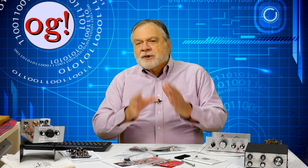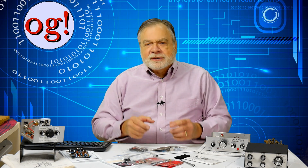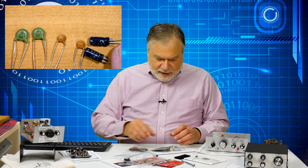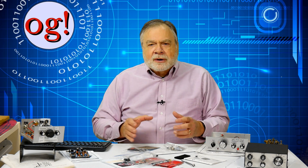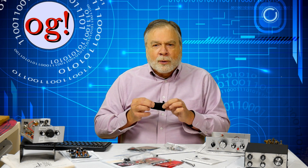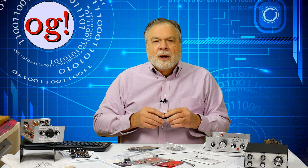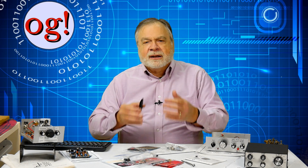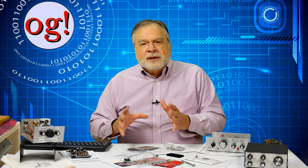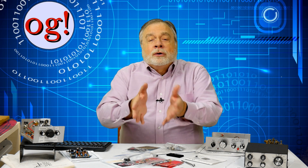Be careful of safety, such as problems that can be created by shorts or applying battery voltage incorrectly. Beware of the soldering iron itself, as it will burn your skin instantly. Wear eye protection so you don't splash solder in an eye. Some of the items you'll be dealing with include the circuit board and discrete components. Note that component marking can be an issue. Some integrated circuits are sensitive to static electricity — they'll often come pushed into conductive black foam, and you need to follow the instructions on how to ground yourself before and during handling the component. Very often, ICs are in sockets. Another thing you can do is watch YouTube videos about your particular kit.